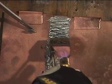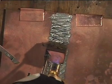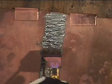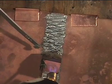The process is extremely similar to the initial soldering, but we are using a lower temperature and proceeding down instead of up the seam. Remember, if the soldering copper becomes too hot, solder will flow out of the seam and off the sheets.